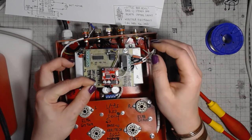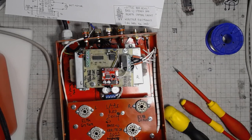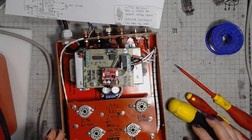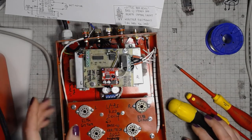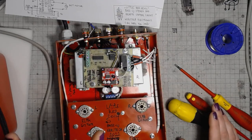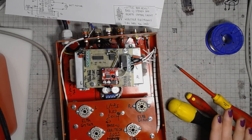having a signal sync that doesn't really go anywhere to the speakers. So only when the amplifier is switched over to the Bluetooth module will the module be put into action. It will get power and it will be visible if you scan for Bluetooth devices.